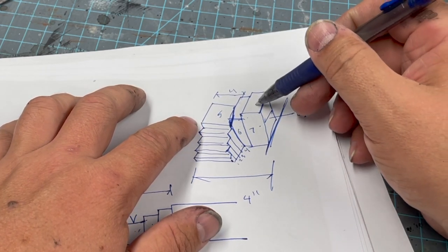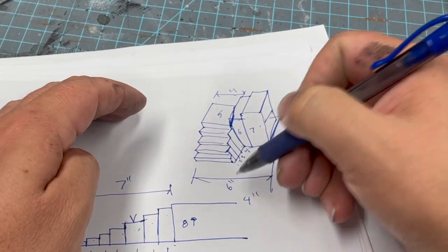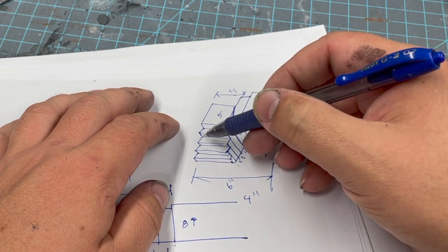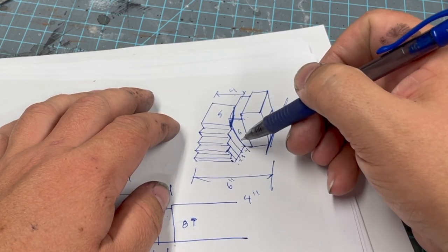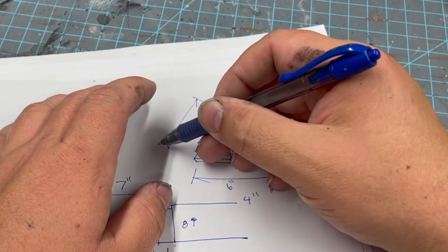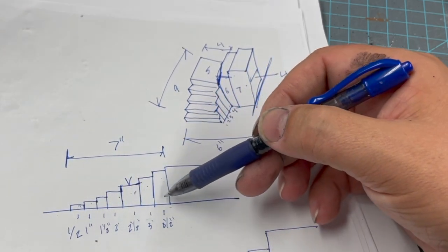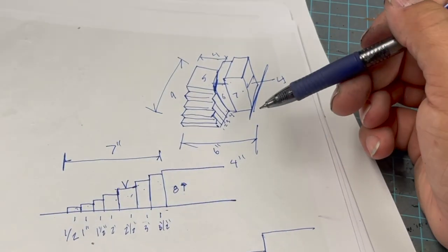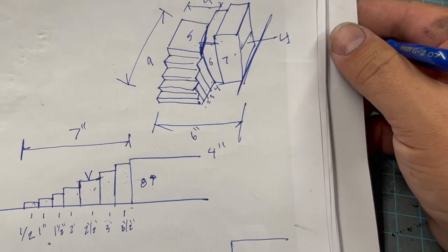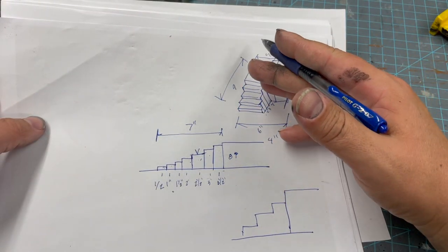So 2 plus 4 is 6 inches. So your overall depth is 6 inches, and then you turn and come down, you've got 4 plus 5, you've got 9 inches this way, right? So you might be able to shrink the dimension this way, but it goes farther out that way. You always have to recover whatever you lose in the other direction. So take in mind these calculations when you start to turn things or move things.